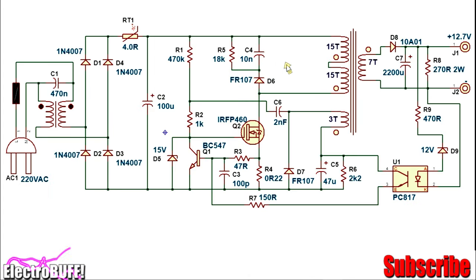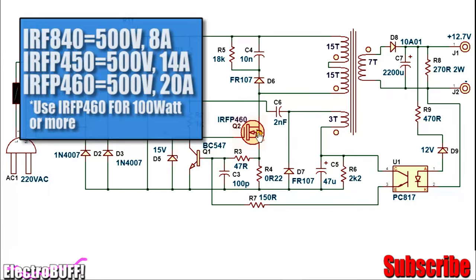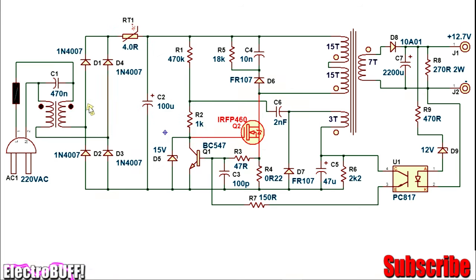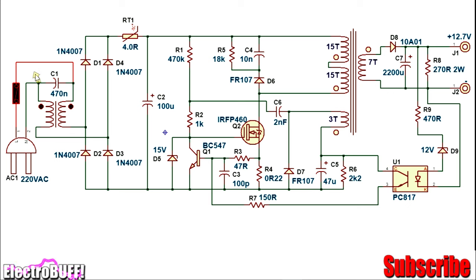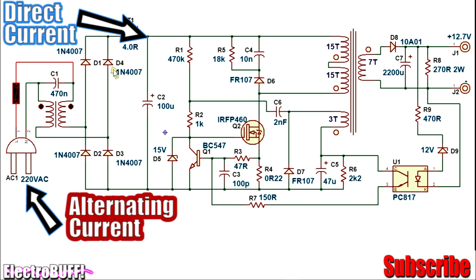Back to the circuit: you need a powerful MOSFET — you can use the IRF840, which will limit the circuit power to about 60 watts. With the IRFP460, you can easily obtain more than 100 watts. At the input you have your mains, which can be 110 to 240 volts. There is a filter made up of capacitor C1 and inductance L1, and a fuse to limit the overall current flowing through the circuit. The diodes form a bridge rectifier to convert the AC into DC, and this will charge the bulk capacitor C2, which will filter the pulsating DC into a smooth DC.